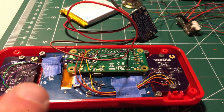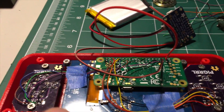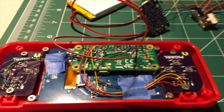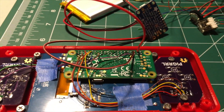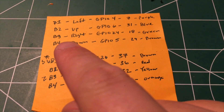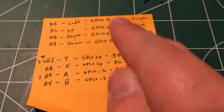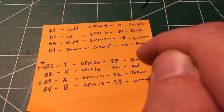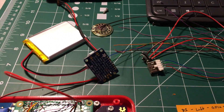Everything's working fine. You've got to plug everything in directly to the ports, so follow my wiring diagram from my original tutorials — I'll make sure that's included as part of this as well. You want to make sure you write all this stuff down as you do it. I lined up my numbers for where they were on the PCB, what they associated to for the actual button presses, then which GPIO pin ultimately, which number the pin was, and then my color of wire. That's how I got everything hooked up.